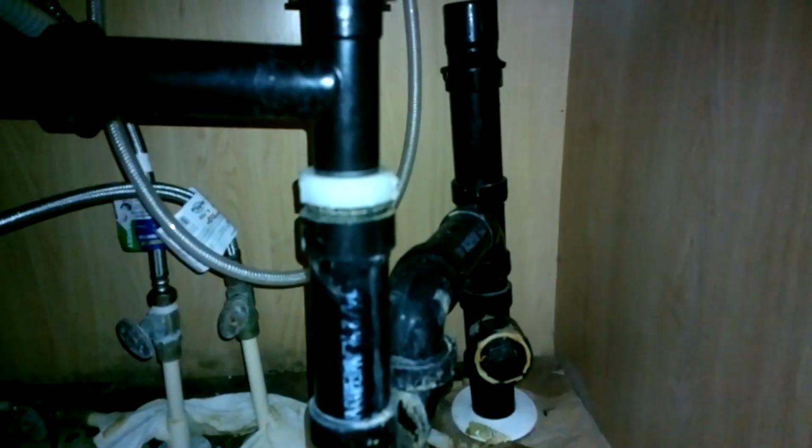We've got a little sink issue here, and as you can see there's a little bit of a leak going on. Probably can't see the leak, but if you have already tightened all your pipes and checked all your glued fittings here under the sink, the culprit might actually be up here higher. That collar, which comes in here, you have this flanged part.